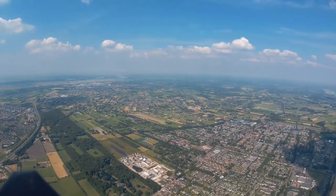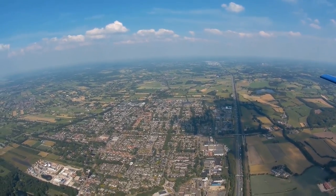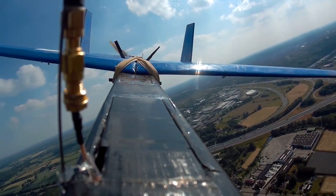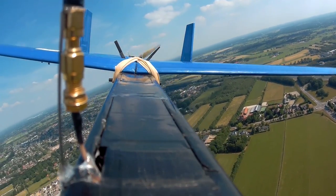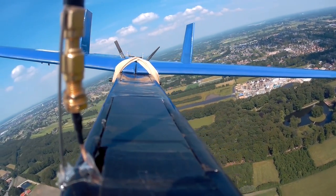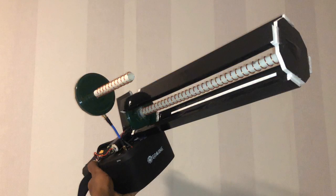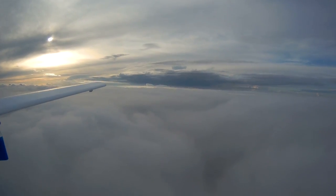This is because the area I live in irradiates a lot of interference, and FPV flights were never enjoyable after 5–6 kilometers with more than 800mW of power because the video link broke up or flashed in black and white every time. So after that success with the 11-turn helical, I built a 34-turn helical to see what happens, with the hope to one day finally fly over 10 kilometers FPV with a solid video signal at 5.8 GHz.